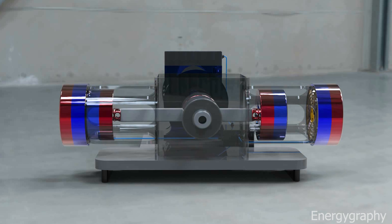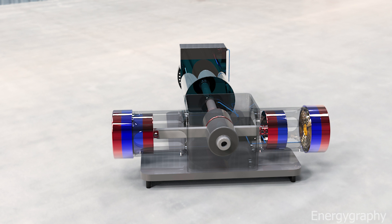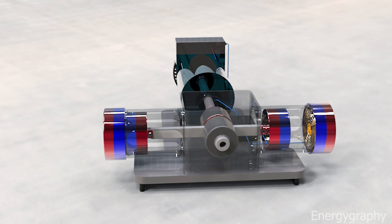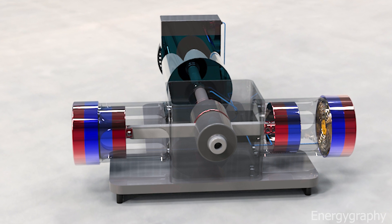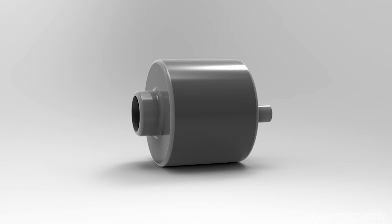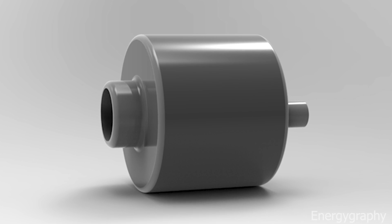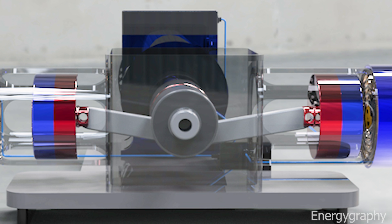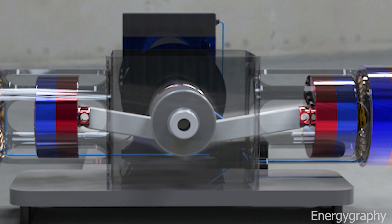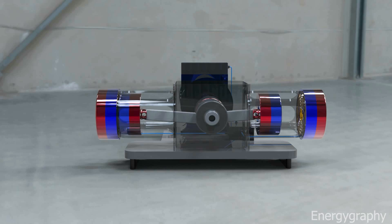Let's check it out and start with the components. The foundation is made of composite plastic, and the cylinder material is Plexiglas, which is used only in this concept model — in a real model, another material would be used. The crankshaft is designed with an aluminium core and a composite shell that is non-magnetic, and is also designed to act as a flywheel. The connecting rod is also made of composite material with an aluminium core.